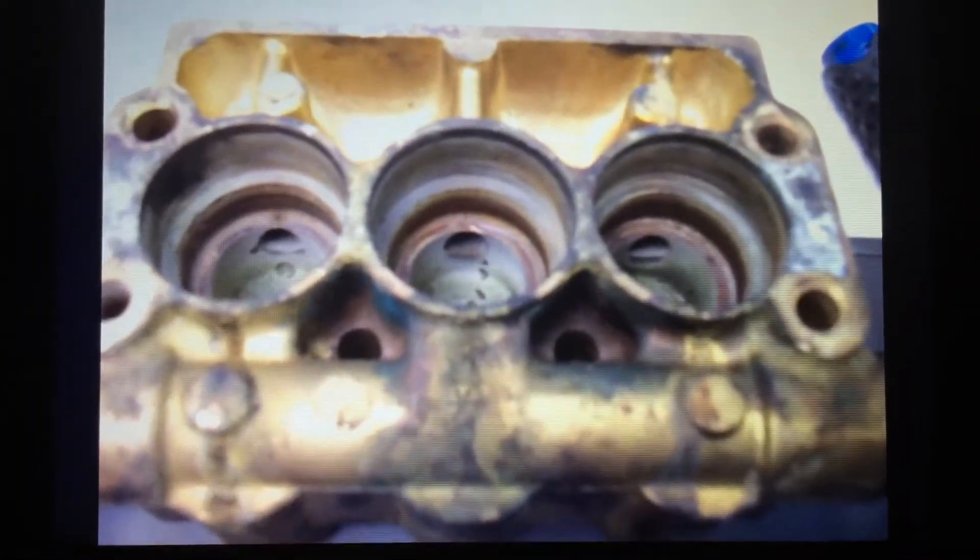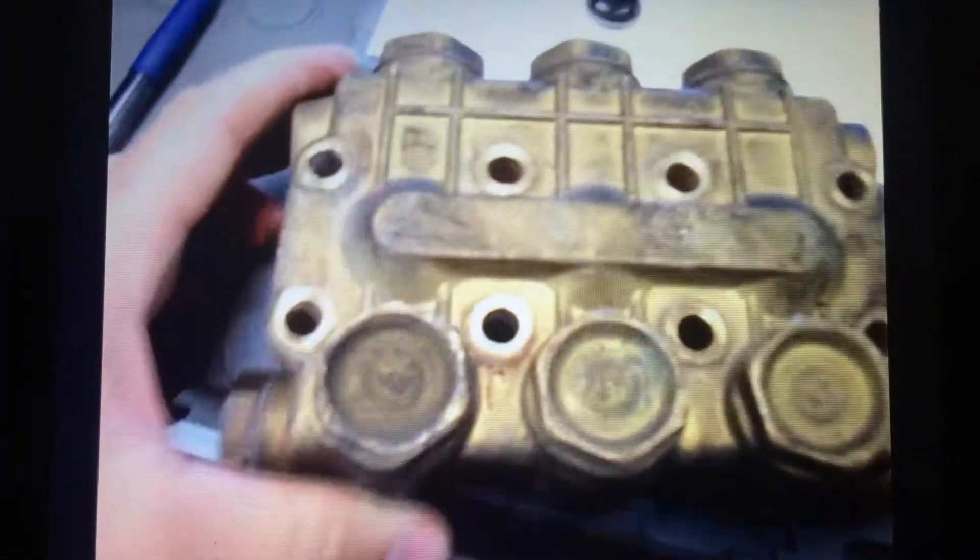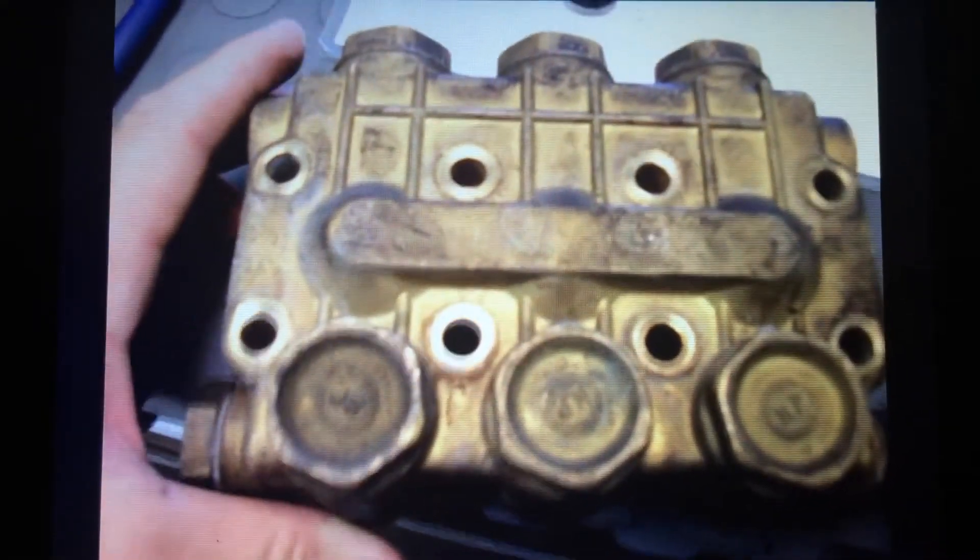It's a water pump manifold — a head, some people call it a head. This is off a general water pump. A lot of people have these in different sizes, where you've got your three inlet check valve caps and then your three discharge check valve caps, your manifold bolts, and the packing that goes inside — pump seals, high-pressure seals — that actually go down inside these bores.